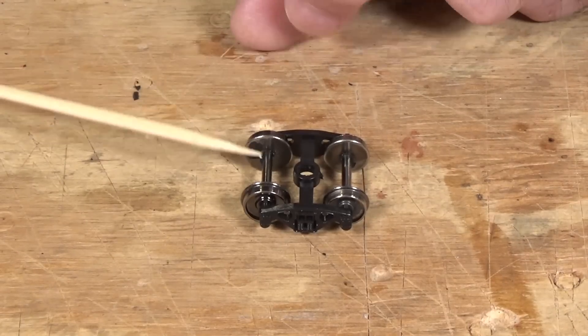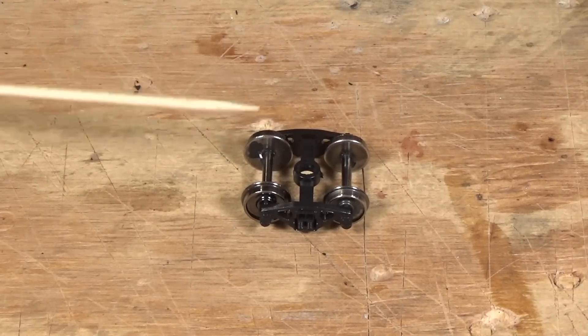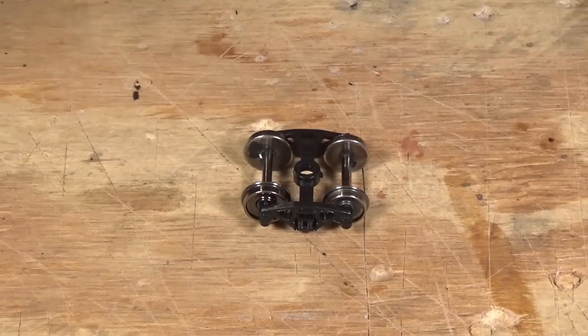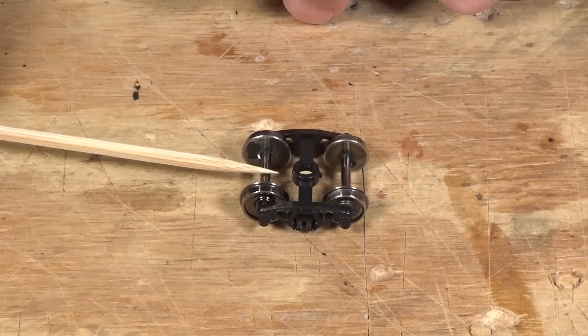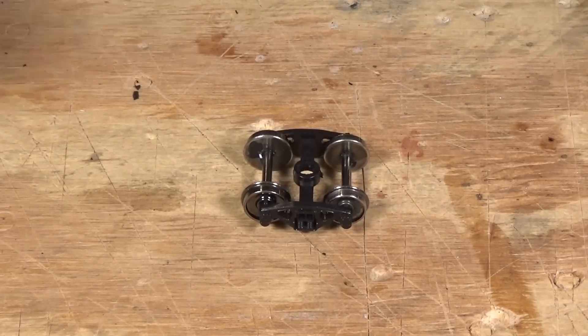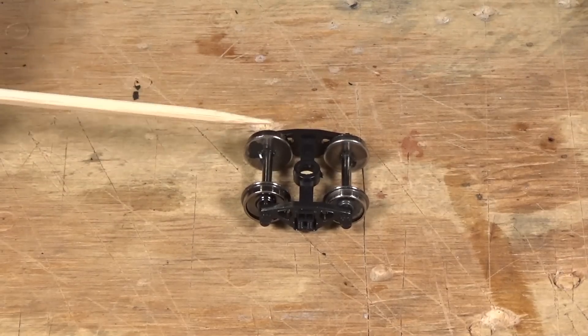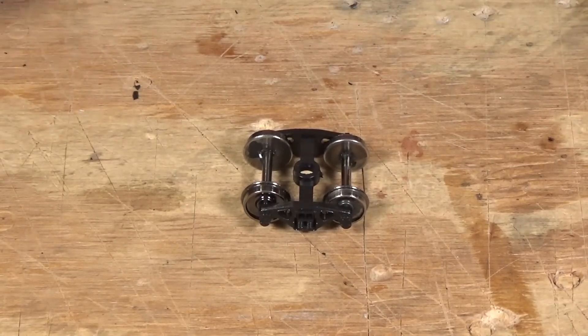Before we get started with a look at the connectors, I want to address a question that came up concerning the resistor or detector wheel sets that I showed you how to make on Monday. When you've got a bunch of these on your model railroad — say 100 of them — how much power is that going to consume? Is it going to eat up everything coming out of your booster? Actually no, because if you do the math, it works out to about 1.4 milliamps per resistor. An LED uses about 20 milliamps, so at 1.4 milliamps per resistor, that's 140 milliamps with 100 of them — even two on each car, that's 50 cars. You can use a lot of these without overloading your booster and still get very good detection from your block occupancy detectors.